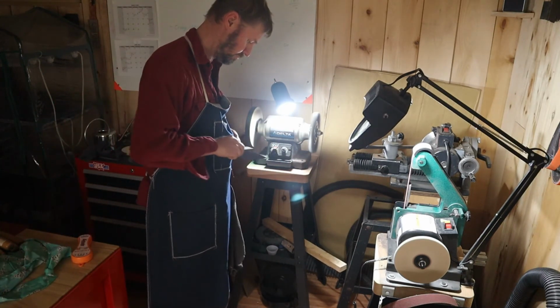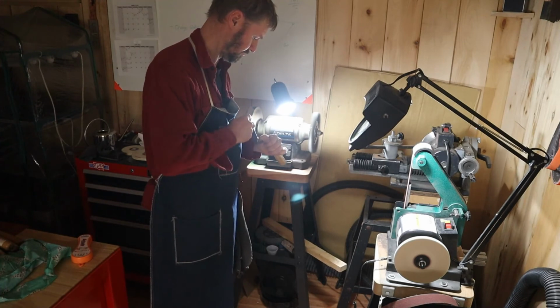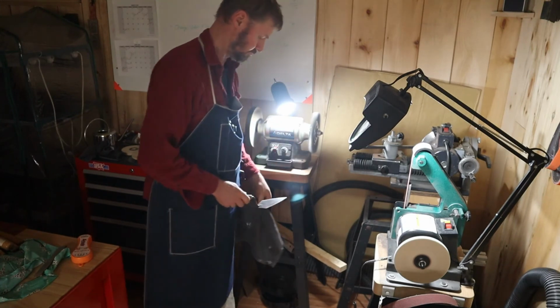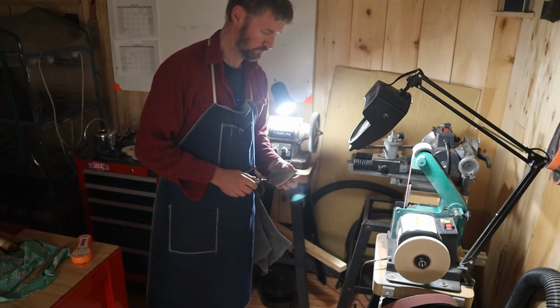I did soak this stone too, just so you know, and clean that burr off of there. I'm gonna push a little burr back to the flat side and weaken that flaky burr with that wire wheel. Use my rag to pull it off. All right, so this trowel has an edge. Okay, I hope that helped you out.